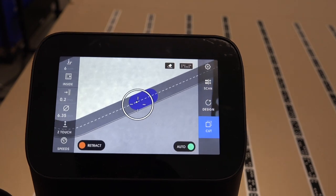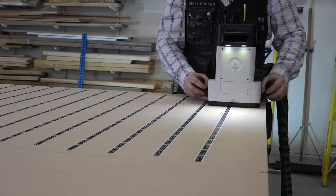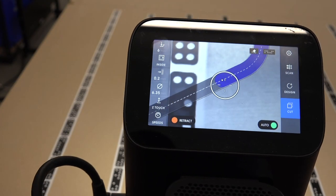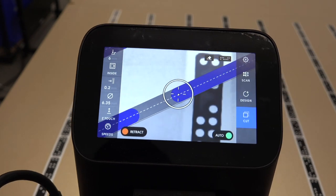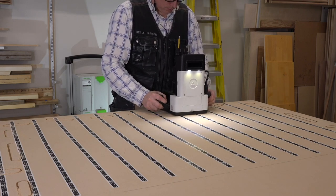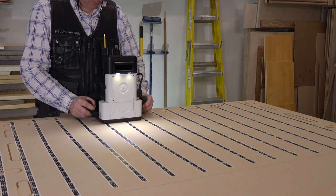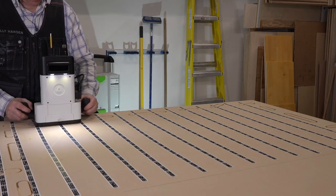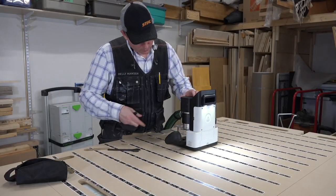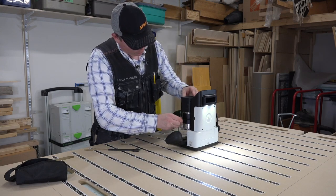It's a green button on the right side of the handle which plunges the router, and the screen shows the cutter's position relative to the stitched virtual image. Origin only lets you move in one direction and you follow the cut line trying to keep the crosshairs on center. The circle delineates the correction range of the tool, and as long as you stay within this range the cutter will follow the line accurately even if you waver a little bit. If you go outside the range, the tool automatically retracts. When plugged into the Festool vacuum, Origin draws just enough power for the computer to operate but not enough to trigger the auto feature. When I turn on the Origin spindle, the current draw is sufficient to trigger the vacuum's auto start.